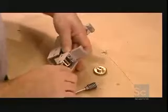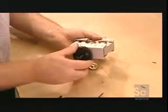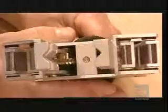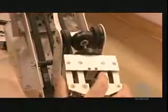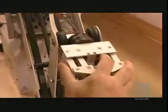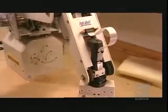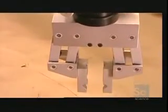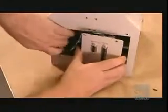Now they can install the gripper and the shaft and gear system that operates it. Turning the gear one way opens the grip. Turning it the other way closes it. Now they mount the assembled gripper to the forearm, plugging its motor into a circuit board that they've already installed there. They plug the wires from all 6 motors into the main circuit board, which they then install at the back